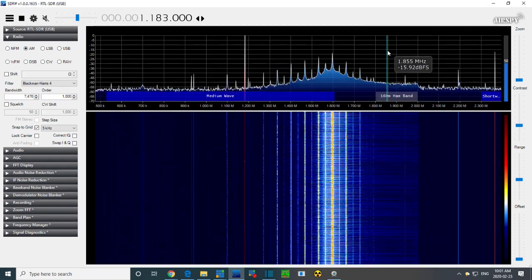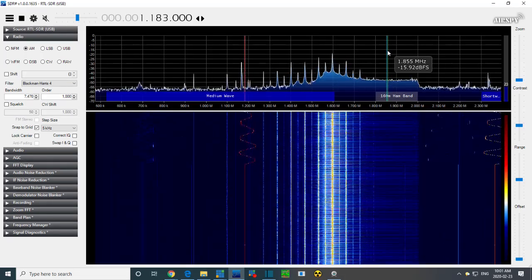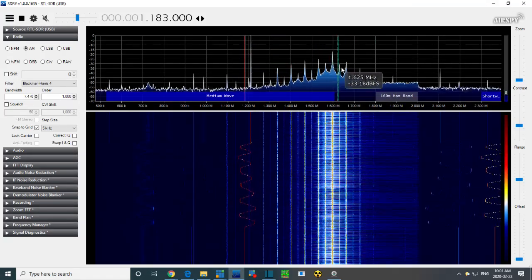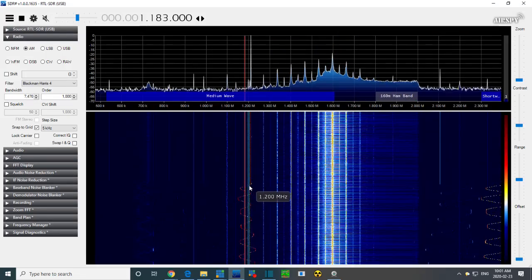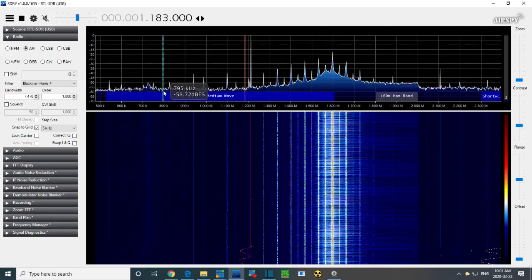So I'm going to tune the radio a little bit, and we'll spot where the local oscillator is just by wiggling it back and forth. A couple of things to note. Something is not moving, and that's this strain. This is an odd curve here. I don't know what to make of this curve. So you saw the local oscillator frequency going back and forth, and did you notice this was going back and forth too? This is the front end tuning response in the radio.